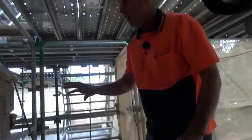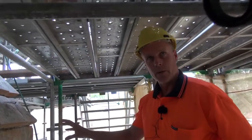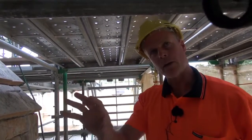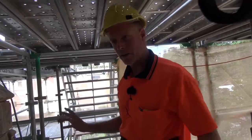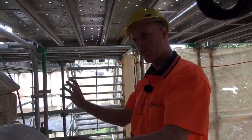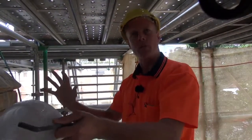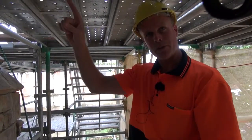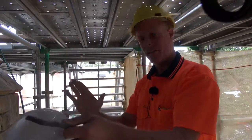This is actually where our biggest concern of movement is in the building. Both the south east and the south west buttresses are holding the south transept up. They're failing, which allows the walls themselves to spread to the east and the west, which then refers back to the spokes up in the wheel window — they've pulled out.